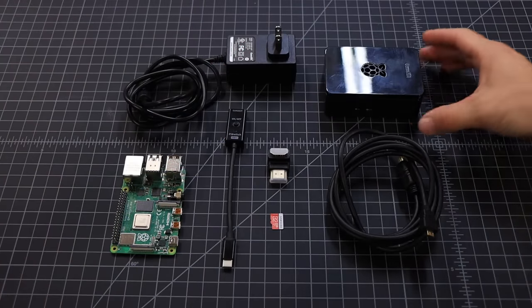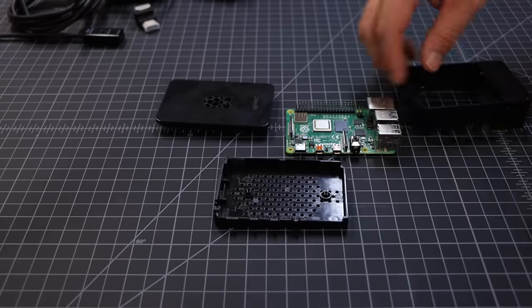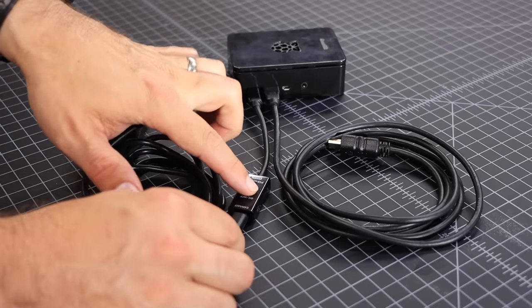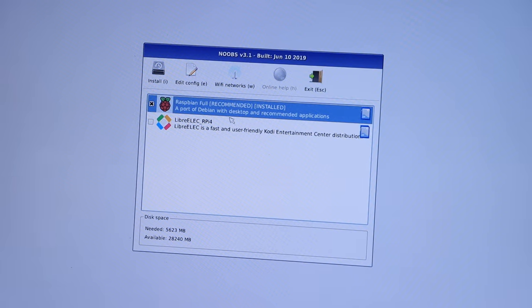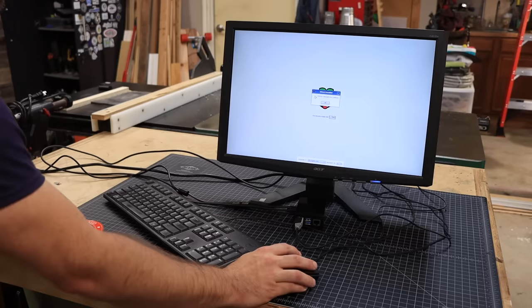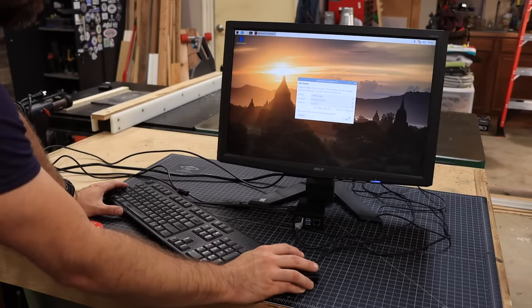If you follow the link in the description, we recommend buying the full kit with the Raspberry Pi because it comes with everything you'll need. The memory card gets carefully installed into the bottom slot, then you install the Pi into the case and snap the rest of the pieces together. Plug everything in and hit the little power switch to turn it on. We'd recommend doing this part first before you take apart the monitor and install it into the mirror. You'll see an installation screen for the operating system — click install in the top left and wait about 15 minutes. When it's done, it restarts and shows an interface like Windows or Mac, and it'll ask for your time zone and Wi-Fi, which is really important because the Raspberry Pi needs to connect to the internet.